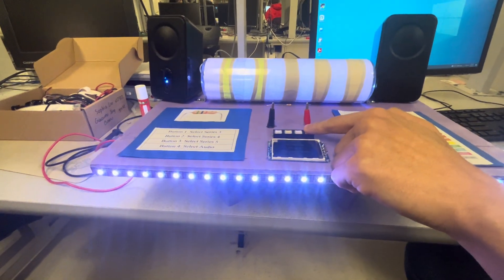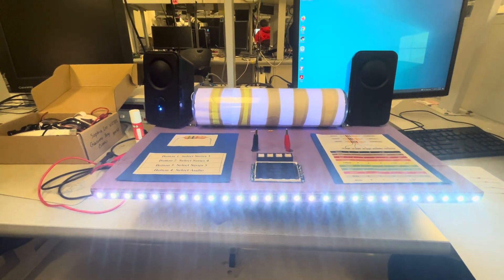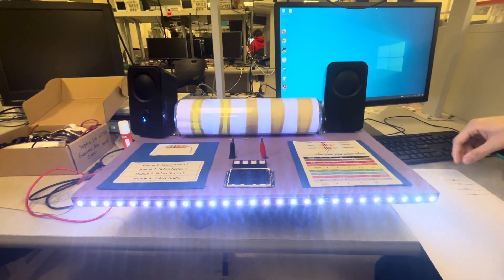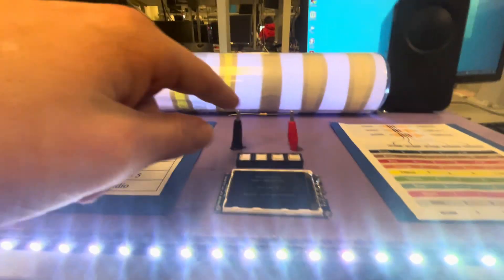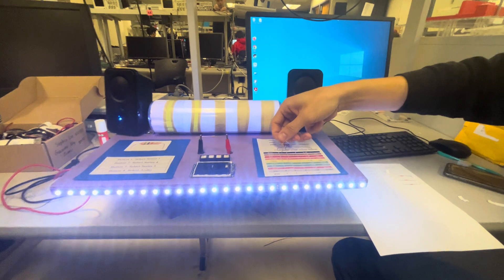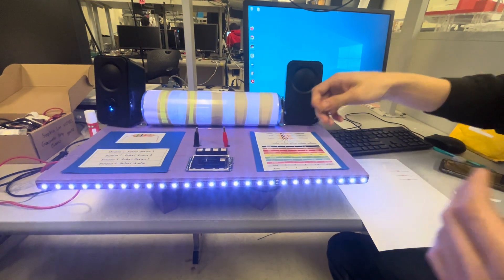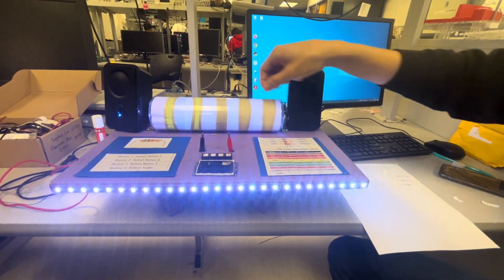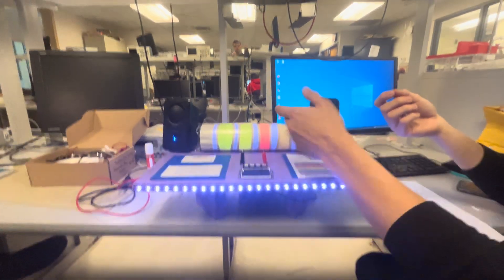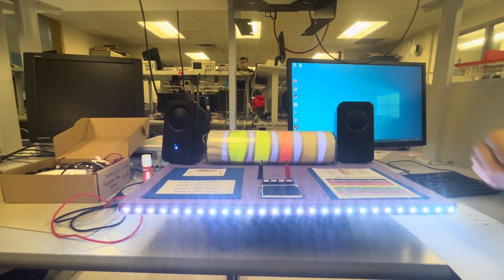With the fourth button, it takes the instantaneous resistance at that exact moment and reads it out: 'The resistance is 4,347 ohms.' There is a match between the colors displayed on the LED lamp and the colors on the resistor. For example, yellow-yellow by the legend is a 4,400 value. With the four-band series, it's easier to see: 44 times 100, with a tolerance of 1%.